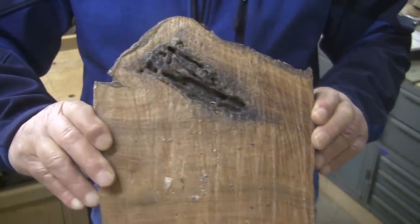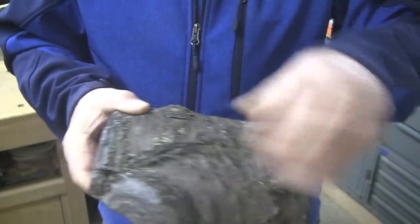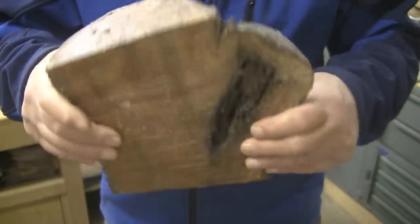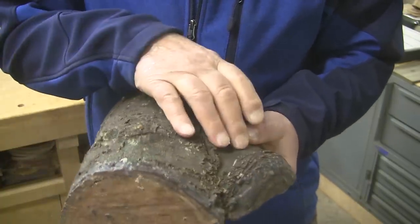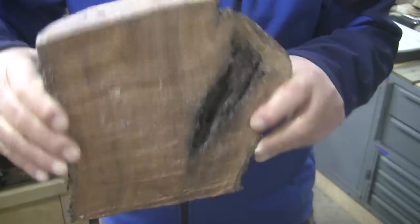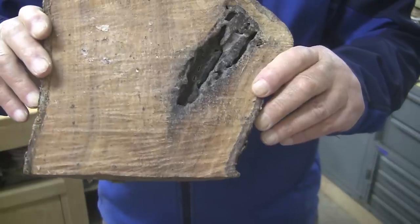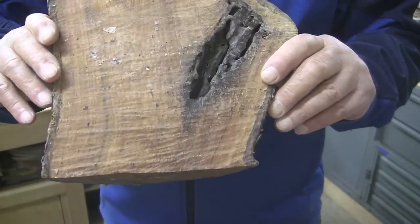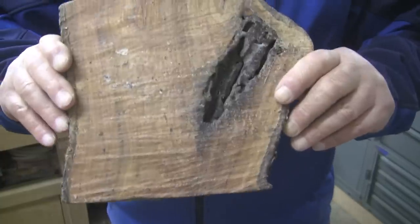There's the defect. It only goes about a half an inch deep, maybe a little bit more. I'd like to save this part of the crotch, but because that defect is where it is, the more I turn away from this side to save that side the closer I get to the defect. I could try to fill it but it's full of wax from the coating on the wood so nothing's going to stick and I'd never get that wax out of there. I thought I might fill it with CA and coffee grounds before I get started, but nothing's going to stick to the wax so I'm going to have to deal with it after we've done some turning.